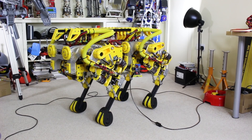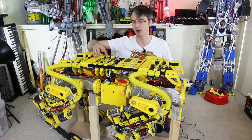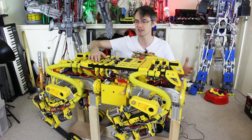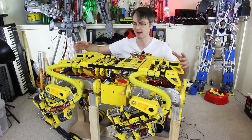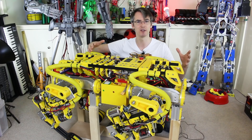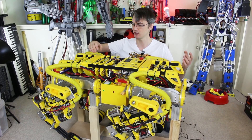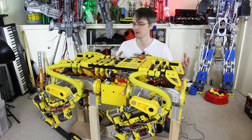This is mainly down to all of the electronics in here — I've got multiple Arduino Mega 2560s, which are only 8-bit and running at 16 megahertz. There are several of these linked to the ODrives, and then one master one which is running all of the kinematic model. The inertial measurement unit is also separate, and everything's strung together with serial, running pretty slowly.